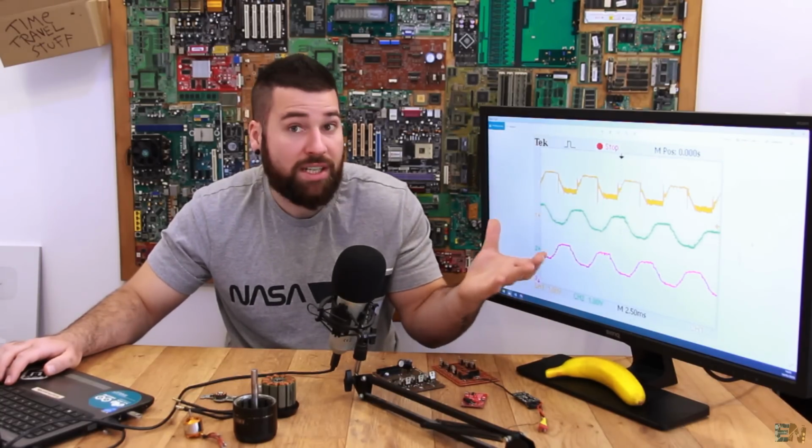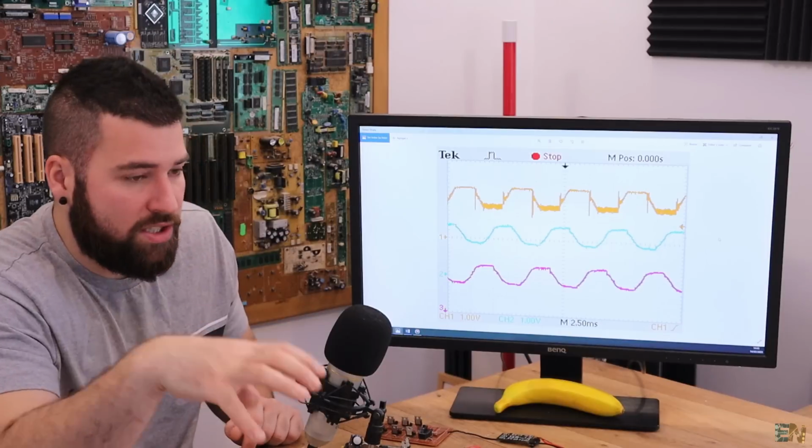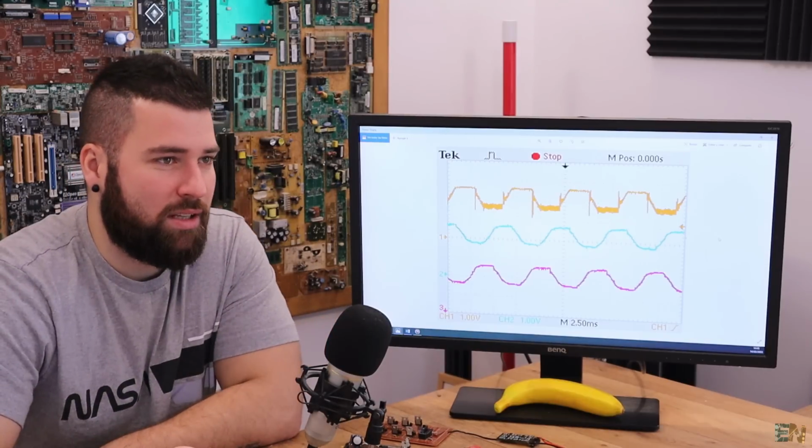So as you can see, if we compare the voltages from these brushed DC motors with these, which are from a brushless DC motor, they will be the same. If you connect an oscilloscope to the coils of each motor, you will get pretty much the same result. So that's why we consider this a DC motor.